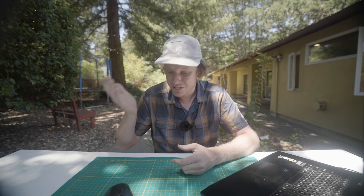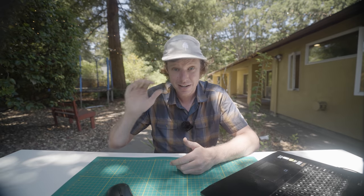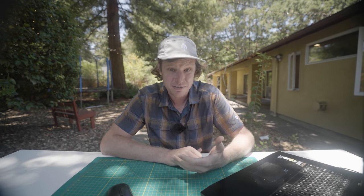Now here's my conclusion in short. The R2A and the miniVUX, these are good for surveying. You can get that tenth of a foot accuracy on that surface model, and you can measure that fuzz and feel comfortable that the data that you're getting is going to be accurate and repeatable. The L1, although it's very inexpensive and affordable, which is awesome, and the colorization looks gorgeous, there is that fuzz that comes with the data set. And also that fuzz is moving up and down over time. So this makes me feel that if you went and flew two times or three times or four times in the same spot, it wouldn't necessarily repeat itself because over time you're getting some undulations.